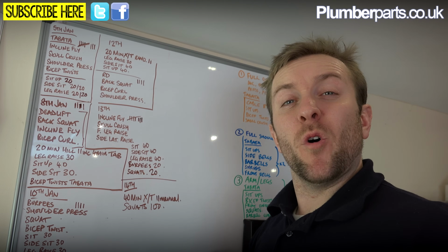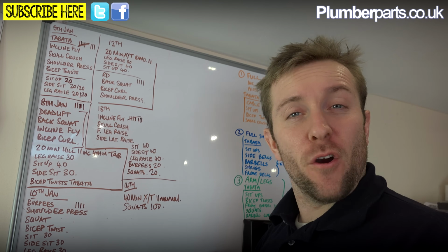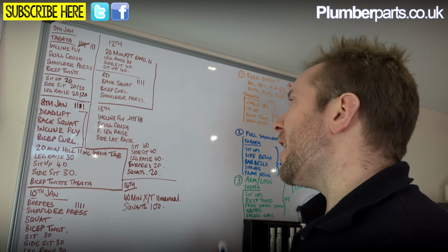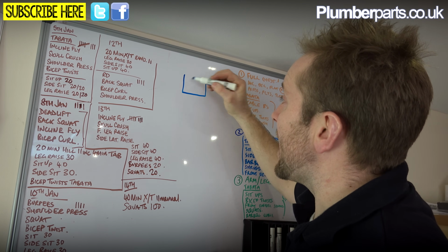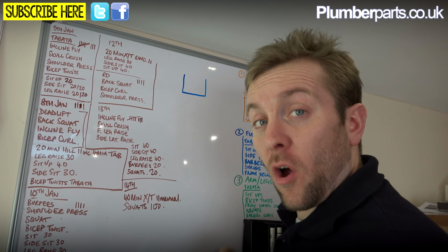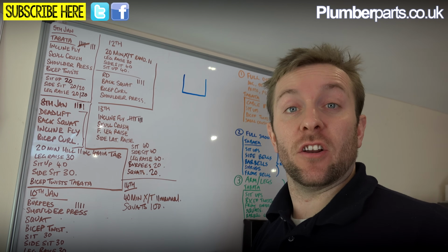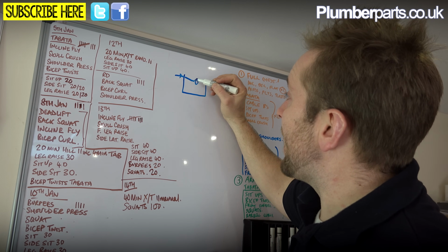So let's just go over what we've been gawping at in the darkness and spider-infested filth of Paul's loft. Don't worry, Paul, everyone's got a loft like that. So we've got our loft tank right at the top, okay? Now usually this tank will feed both the hot water tank and also the gravity cold water feed to the shower you're looking at. Alright, so you'll have your cold water main in with a little ball valve up there.